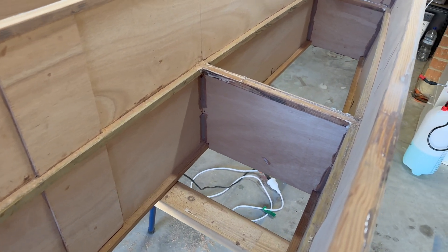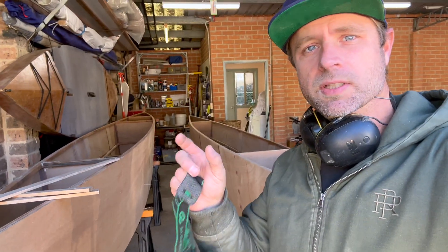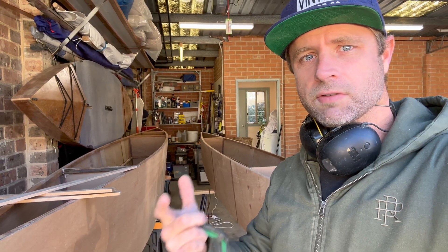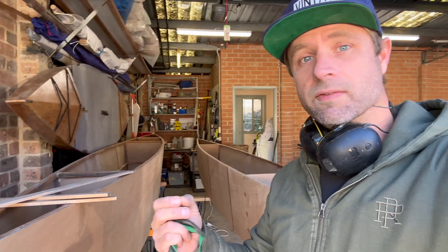Cockpit sole framing is all in now. I'm going to take the belt sander and start cleaning up all the top edges here on the hull sides. After that, I'm going to put some really big thick epoxy fillets in all the joints — those big fillets are going to add a lot of structure. Then I'll put some fiberglass tape over the top of them to make sure those bulkheads are really well bonded to each side of the hull.